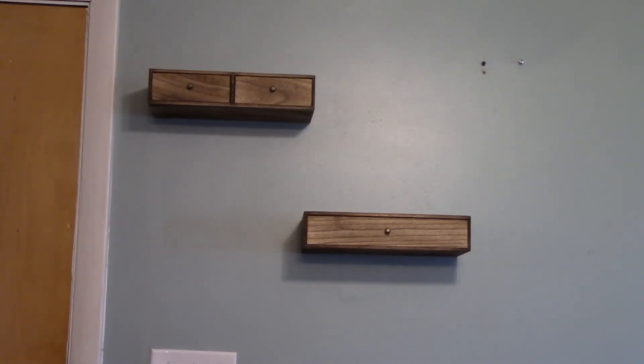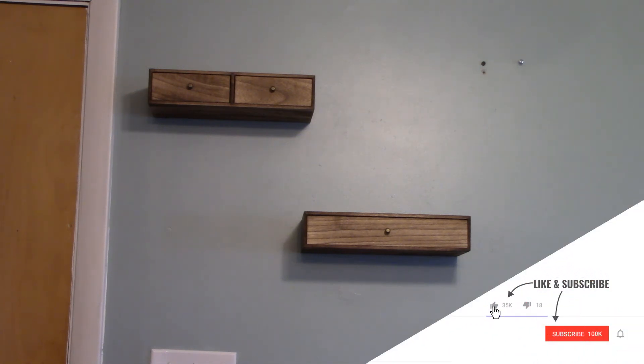All right guys, now that we have our shelves hung, we're pretty much ready to go — just start putting stuff in there. When you put your shelves on, make sure and leave those screws sticking out about a quarter inch, maybe a little bit more, so they're kind of snug. Once you set it on there, you'll have to push down with a pretty good amount of pressure — not overdo it, because you can either break your shelves or rip it out of the wall. Be sure it's a little bit snug, and then put your level on there afterwards — you can slightly adjust if it's just a slight bit out of level. The top one was off just a little bit, but the bottom one was pretty well perfect. If you're off your mark even just the slightest bit when drilling, it can adjust how level that shelf is going to be. Otherwise, you're ready to go — put anything you want on top of it, inside of it, up to the weight it can hold. I hope you enjoyed this week's video. Be sure to like, share, and subscribe, and consider supporting BS with AJ on Patreon so we can do bigger and better projects. I'll see you next week.